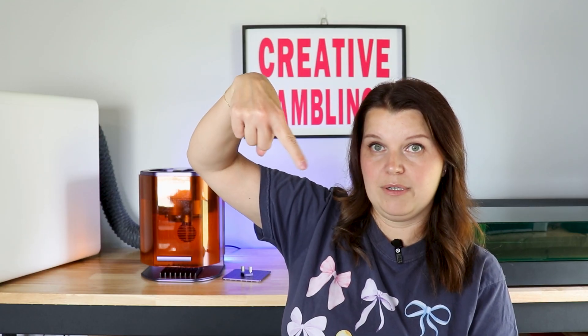The other drawback is that when you are engraving with this, it is unidirectional engraving. A galvo-style laser moves back and forth, but on a unidirectional laser it starts on one side, engraves, then the laser moves back and engraves again — one line, one direction. Most other galvo-style lasers are bi-directional, or you can switch it in the software, so they go a lot faster. This is just a little bit slower. The results are excellent — it's just a little bit slower than some other lasers out there.